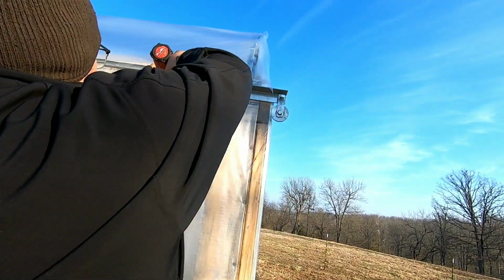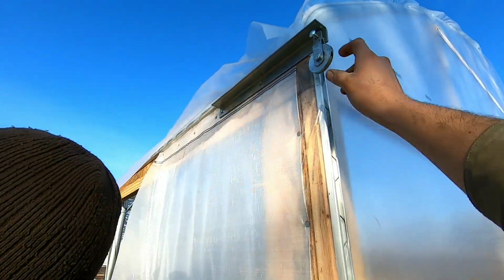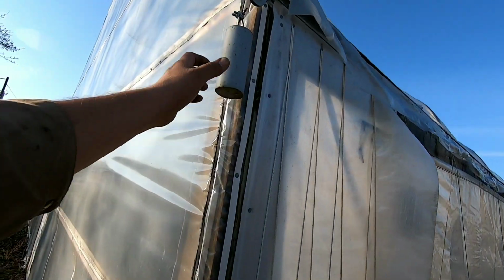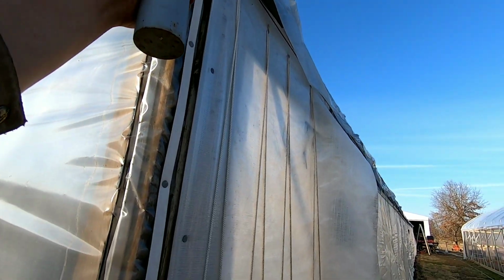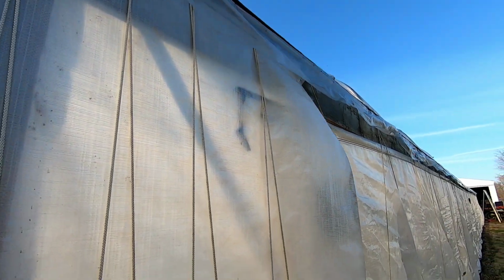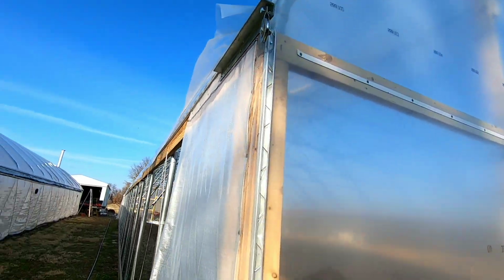Alrighty, on this end of the high tunnel, Morgan County sends out one of these angle things. This is for the weight that comes with it, because every single weight pulley system has a weight on the bottom, like right here. This weight system is for the cable, so it can stay nice and strong. If I pick up the weight here, it comes loose. So you put an angle iron on each end, and the cable stays nice and strong.